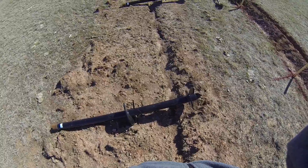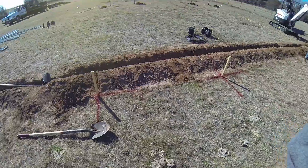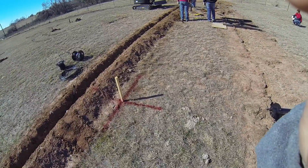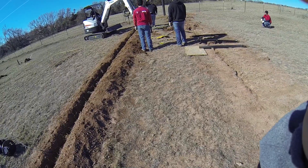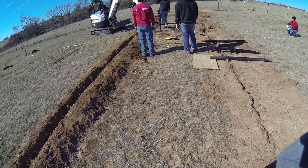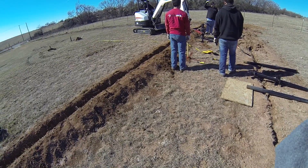This is what our piers look like. The soil here is not very deep so they only have two helicals on the pipe. Rocks and things can move them around, so we're checking to make sure everything is going to be square — we need to be within an inch, so we're double and triple-checking.